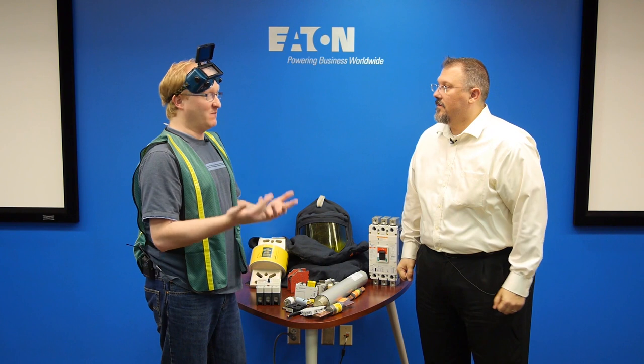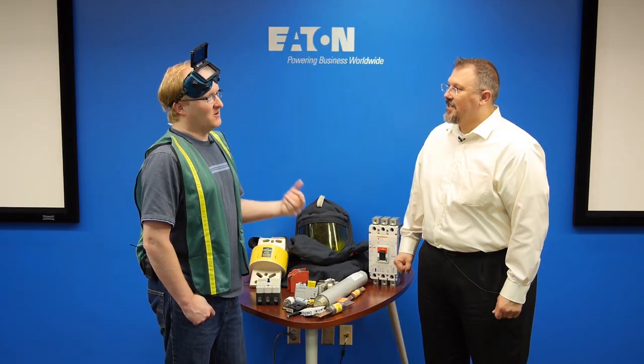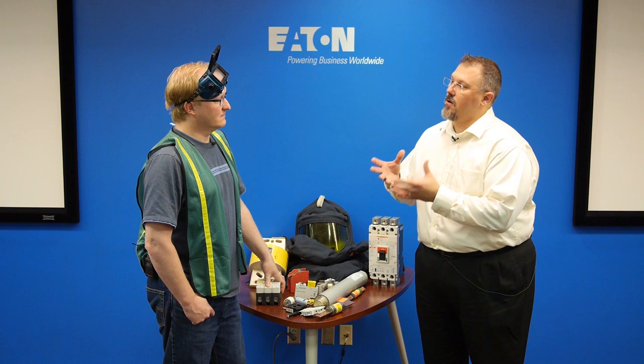That must have been quite the surge — I've never seen a light bulb explode at home before. That was a 3,000-amp surge, and a light bulb just can't handle that much current in that short a period of time. Again, it's worst-case scenario. If that had been a computer, a hair dryer, a microwave, or a plasma television, it probably would have been destroyed. And sometimes it doesn't even take a very large surge — small surges over time, it's like dropping water on a bar of soap, or like high blood pressure that eventually ruins your cardiovascular system.